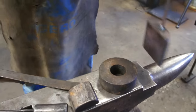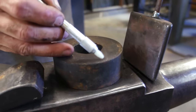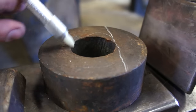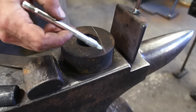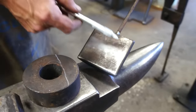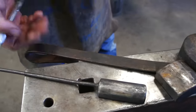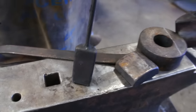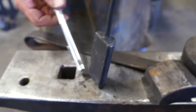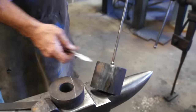So if you want to make this tool, imagine a piece that's 4 inches round or 5 inches round but taller, and you just basically draw a line. It can be one with a hole in the middle or a solid piece, and you put this in your bandsaw. You can weld a shank to it, then cut the piece and you have it. Radius the edges, weld a handle to it. The second one is just a smaller version with a different handle and at an angle. The third one is just a small half round which is pretty useful too, and very easy to make — just take whatever diameter you want, cut it down the middle, and weld the handle to it. I'll go ahead and give a quick demo on using the big flatter.